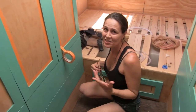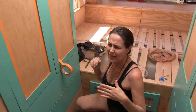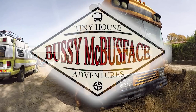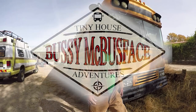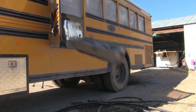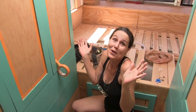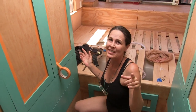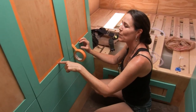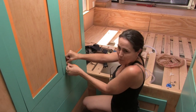Like everything else, I looked it up on YouTube. And usually the two main ways of antiquing are with stain and with a really heavy dark furniture wax. I got both — for a specific reason, and you'll see that as we go along. I'm going to use stain on the faces of these, and then the heavy wax for the edges in here because there's some flaws I need to conceal.